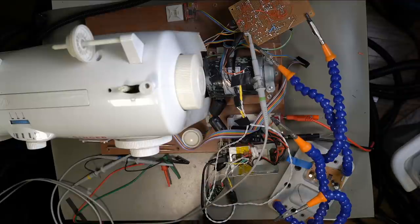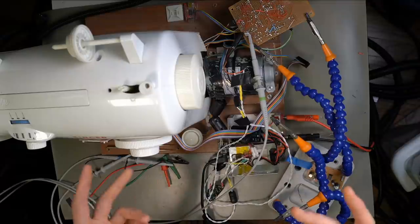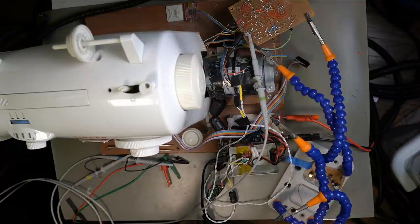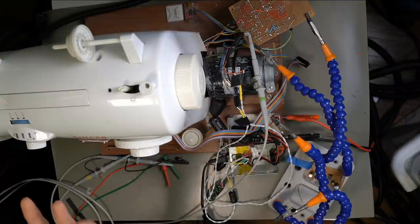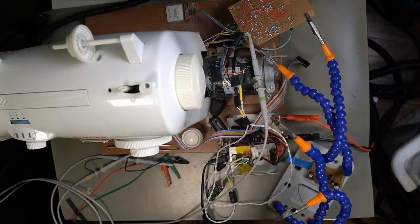The other symptom is that the user interface would just stop responding. So that to me indicates that the main loop thread, the loop that checks what mode it's in, samples the pedal and sets the motor controller information, is what's getting hung. It's actually doing the modulation in a software loop. So if the PWM cog was hung, then the motor would either be stuck full speed on or full speed off. So it seemed like a really specific kind of crash, which was especially weird to me given how bad the EMI noise was before.